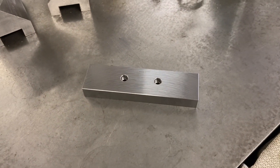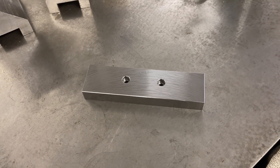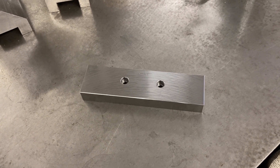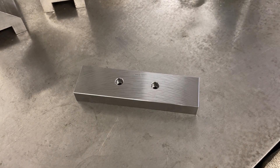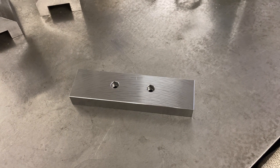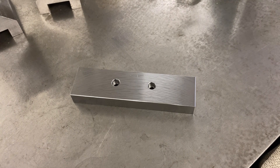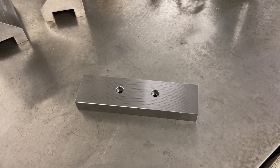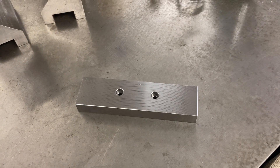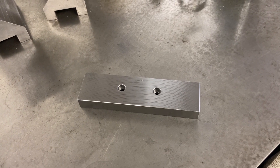This is what we got — we start with a square piece of material that's been ground on two surfaces, milled all around nice and square. This way when we do more than one of them, I have a fixture. I can keep loading them, bank them against the dowels, screw them to the fixture, tighten it down. We work off the center line of this thing, so they're all the same length. When we start with them like this, the two holes are equally distanced off the center line.